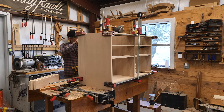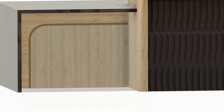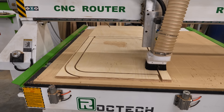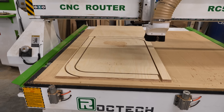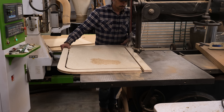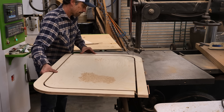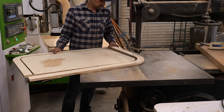There are really four main components: the underside, the drawer box, the front box, and these two side panels. You can see that brass U-shape going through there. We're going to make that piece first, then the other two pieces and clamp it all together into a three-piece panel. Having the CAD program and CNC makes this really easy. This is a three-quarter piece of plywood — each one of these little L-shapes will get brass veneered to the face. Right now I'm just cutting tabs off at my bandsaw. Thankfully the big Oliver has a three-by-three foot table so you can cut bigger pieces without much issue.